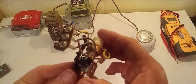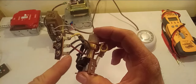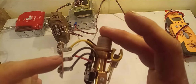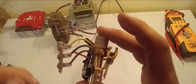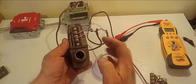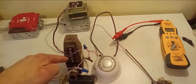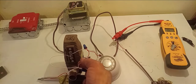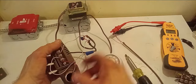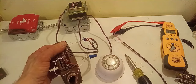Now we're going to move on to the T and T circuit. Off of terminal two you have a black wire that goes to one side of your end switch, and off of terminal three you have another black wire that goes to the other side of your end switch. Off the number two terminal we have the red wire that completes our power circuit and the black wire that goes to our T and T circuit — you can think of terminal two as a mutual common wire for both circuits. So terminal two and terminal three is our T and T circuit. We're going to wire our T and T wires to two and three. I ran a wire from the number two terminal and hooked it up to the common from my transformer and one leg of T and T all together.